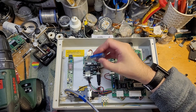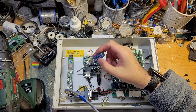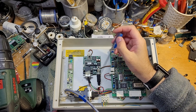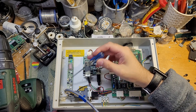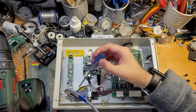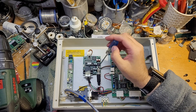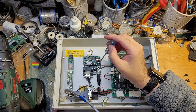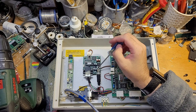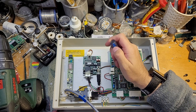We have the CFL backlight. When this CFL dies, I will probably end up replacing it with LEDs — why not? It takes power directly from it — 12V. This is basically what the 12V drives. Although, to be honest, there's a 5V regulator, a 7805. This could have been designed to just run straight off the 5V — that would have made more sense.